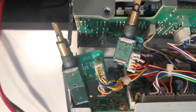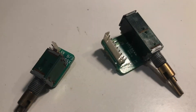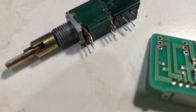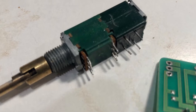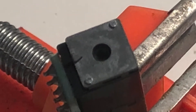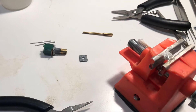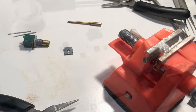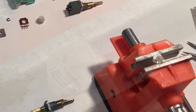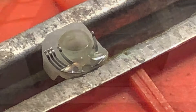You can see them there pulled away from the front panel. They unplug — we can unplug the little boards and then we need to unsolder the pots from those boards. We then need to file the ends of the rivets so we can take the back plate off and remove the wiper, where the metal wiper has actually detached from the plastic mounting. And there's the actual repair with the metal wiper re-glued onto the mount.